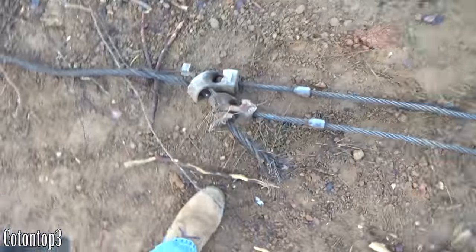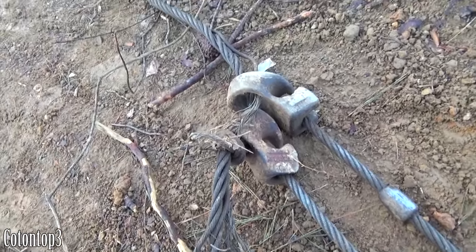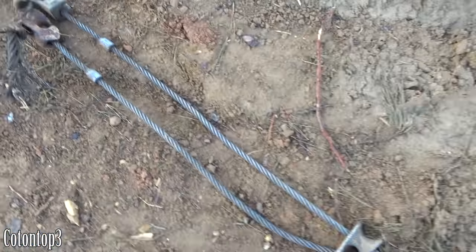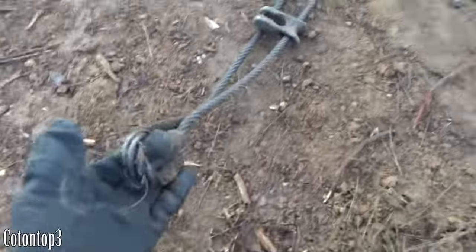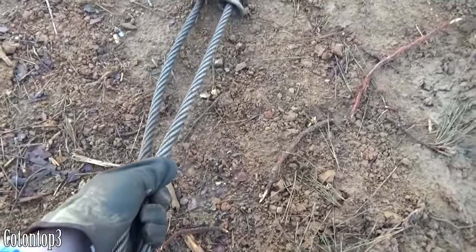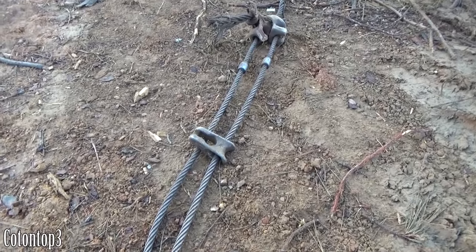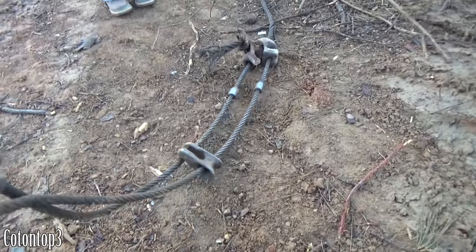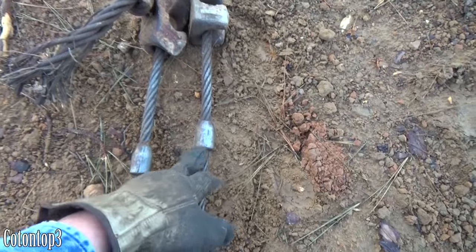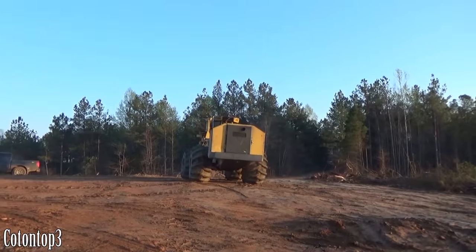This is how we pull trucks. That's the knot right there — I'm going to tie that knot and bring it down just like that. We run two slides: a little slide against the knot and then the larger slide. All of our trucks have a center pull on them and we double that choker cable back and put this in right there, because then you've got double strength. By using a center pull you're not pulling the truck off into the ditch on one side. That's why we run a center pull, and we don't pull on the ends of the cable back to the truck either, because you'll snatch these balls off all the time. So we double it up, come back, and that way we get full strength.